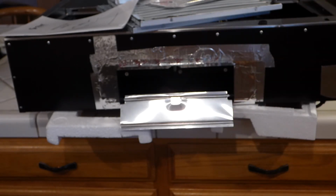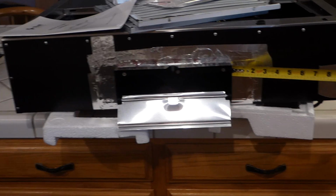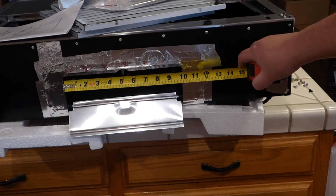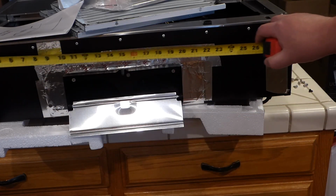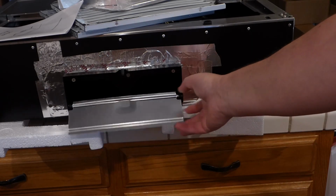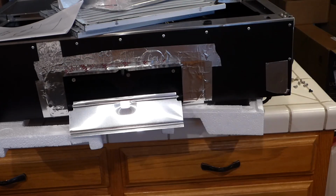Anyways, my point is that we'll do a little measuring instead of going by any kind of schematics. So I'm going to do non-GD&T, going from point to point. If I start from this side and go over to that, we got about 10 inches. That's part of the ductwork. This right here is about 9 7/8 maybe. And then over yonder, another 10 inches, so this is about centered up. The other important measurement is underneath here, about 1 inch. I'll do a better measurement before I start cutting.